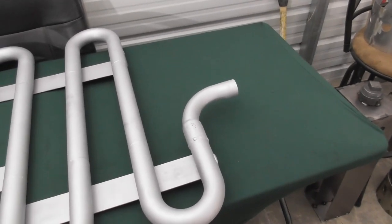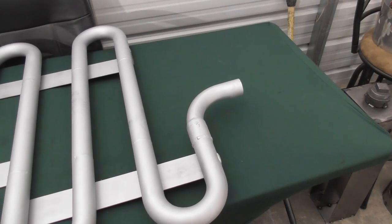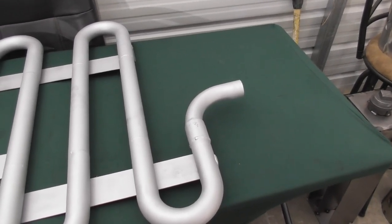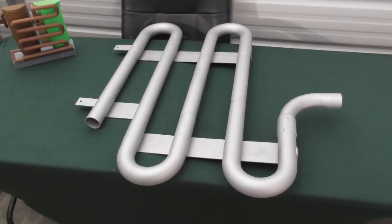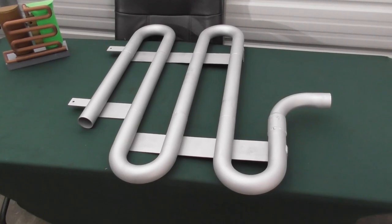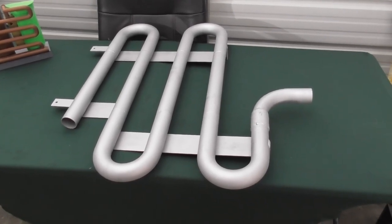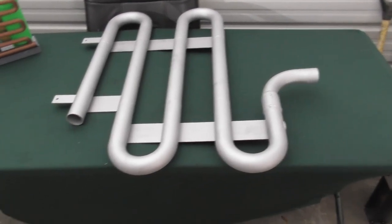And again, if you want to follow the assembly in the PDFs, you just turn that 90 degrees and go straight into the top of the heat exchange. So you got two options there. So this assembly, the metal is pretty light gauge, so be very careful. Dial down the welder. Make sure you do the leak testing, and then you should be good to go.